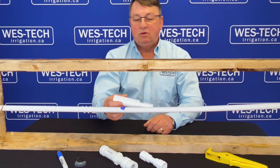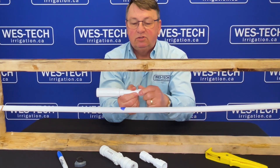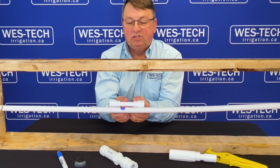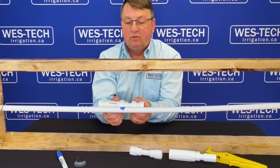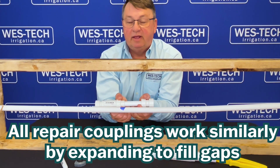So one of the things we have is something called a repair fitting. The repair fitting expands. This one uses a coupler, expands, and is glued in. This one is glued in and actually both sides just expand either side of the hole. And then this is another expanding coupler that goes in — it doesn't need any glue. It's made with PVC lock and it expands and fills the hole.